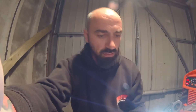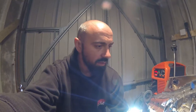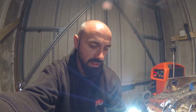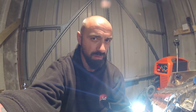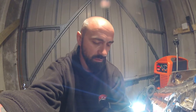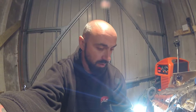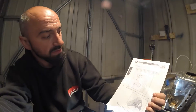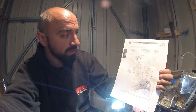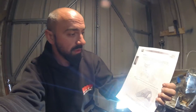As I mentioned in the last video, we've got some schematics — all in French and I don't read French — of how the S1600 rally cars and race cars were prepared. You can download these off the internet; if anybody's interested leave a comment and I can dig out where they're from. They show where stitch welds need to go, and on the sides give you the locations for stitch welding the turrets, surrounding areas, engine mounts and turrets — that's what I've been going off.